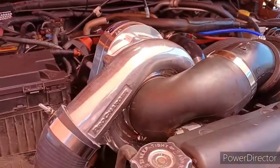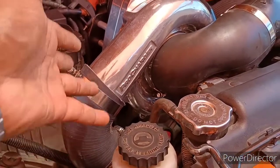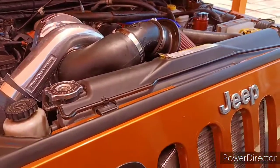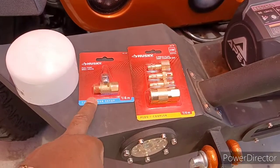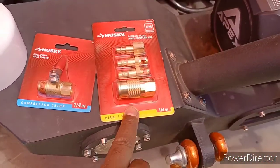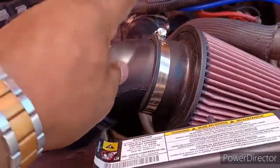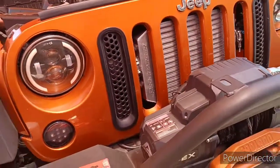I've got a leak somewhere in my system. I took the main hose off and I'm getting a ton of blow — it's blowing out as hard as it can and still not charging the system up. So what I'm gonna do is use this 3-inch cap and a full-port ball valve and a few couplers to hook it all together and use that air compressor to charge this system up, pressurize the whole thing, and see where my leak is coming from.